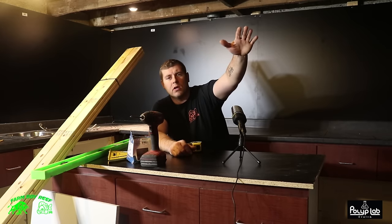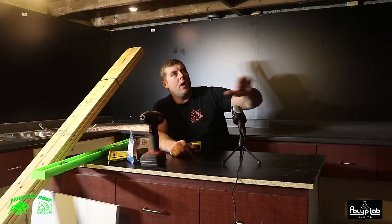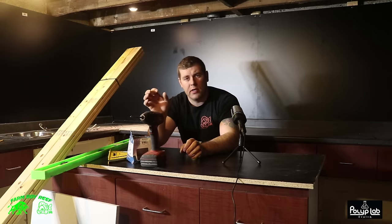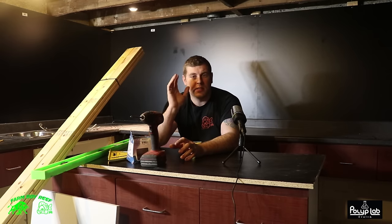All my plumbing is gonna be going across the ceiling to the sump. So I'm gonna put some backing in behind the strapping, so there's a spot so we can hook all the nice pipe clamps nice and even perfectly. So there's some support behind that. I'll show you guys after what we're gonna do there.